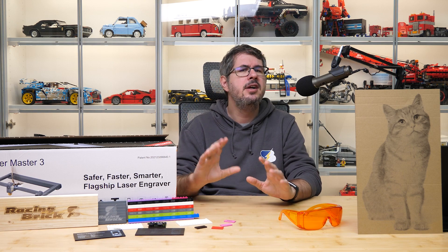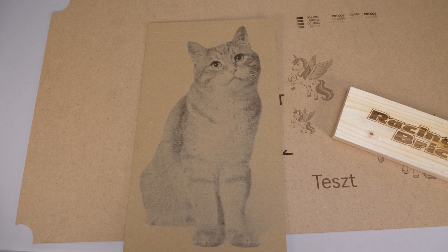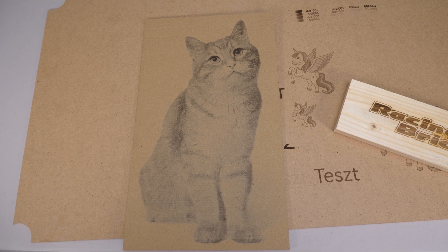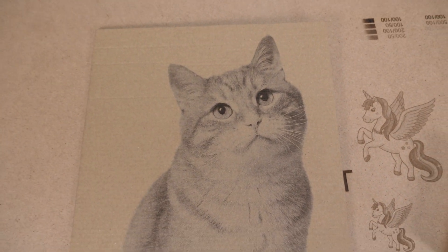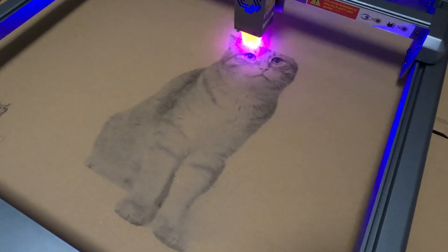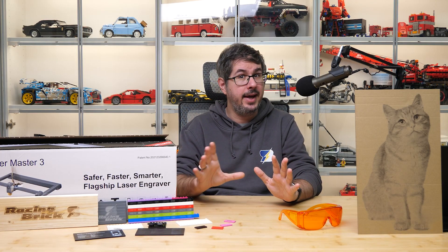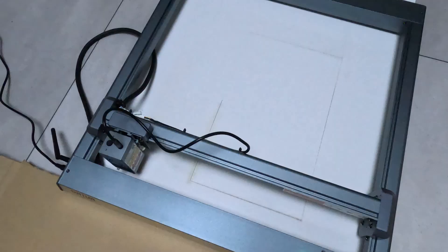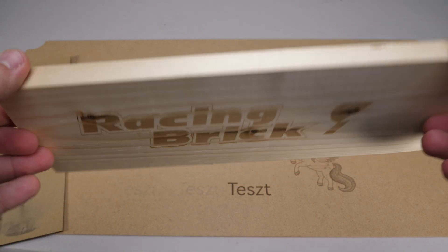Now let's go back to more convenient materials. This thin wooden shelf used for initial tests looks pretty good. Here's an interesting one — a simple cardboard. My daughter wanted a picture for her cardboard fort, so I made this one. It is roughly 35cm high, using almost the full height of the engraving area, and took about 50 minutes at 250mm/sec speed and 100% power. I also wanted to cut it, but quickly realized that's a bad idea without a proper cutting platform — the shelf I used as a base has serious burn marks. I also engraved my logo on a piece of wood at two different power levels and I really like the end result.